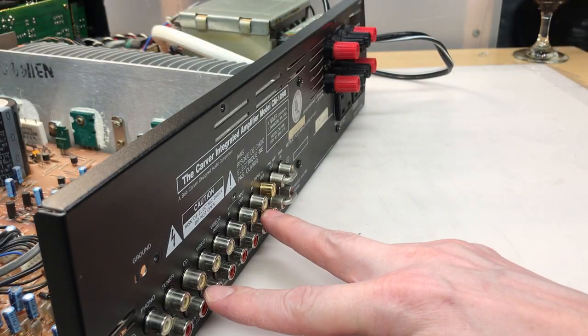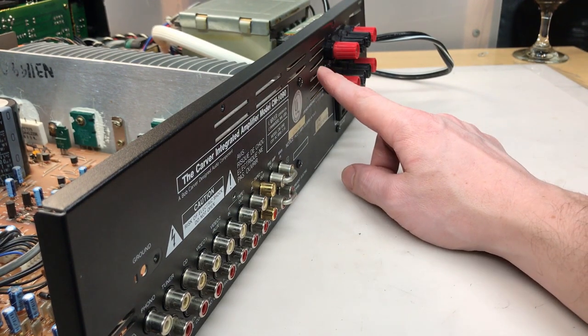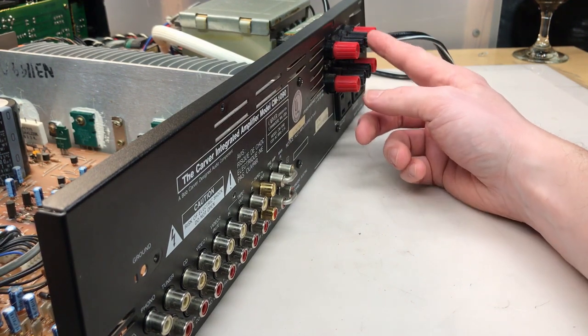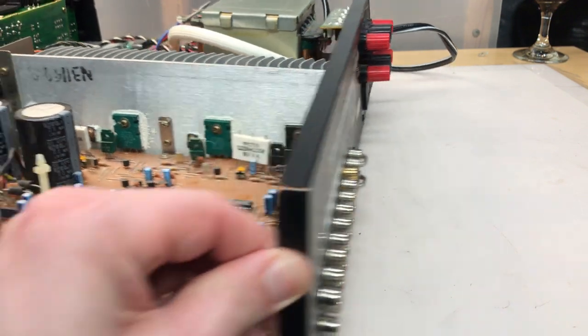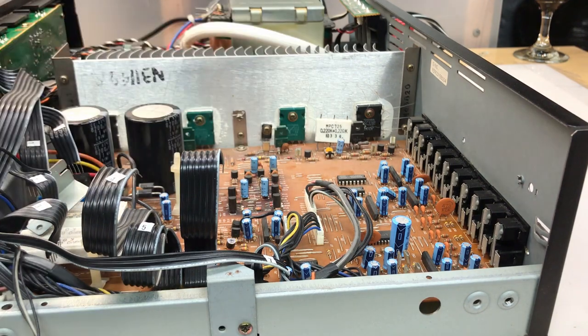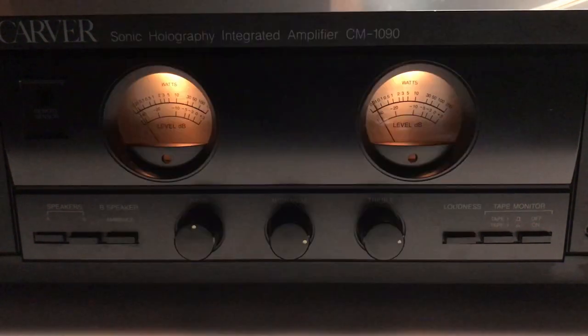The two RCA jack sets are swapped, and the CD jack should be pretty good now. I also straightened out the back cover as best I could - I'm not a machine shop, so it's not perfect, but it looks much better. Thankfully the speaker binding posts and the board they're attached to were not damaged at all when the cover was bent. The next step is to get the main board recapped and also replace the heatsink-mounted transistors. All of the electrolytics and power transistors have been replaced, the final sound check is testing out perfectly - so that's it for this one. We'll see you next time.